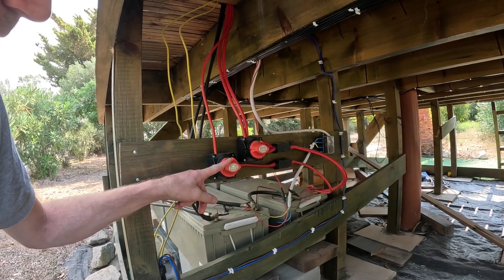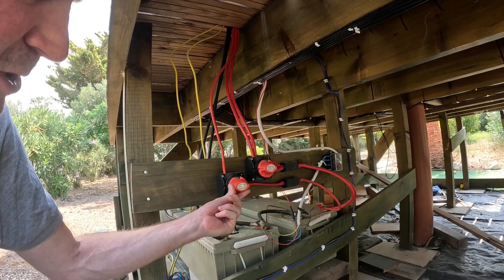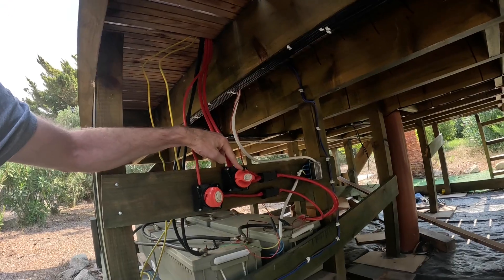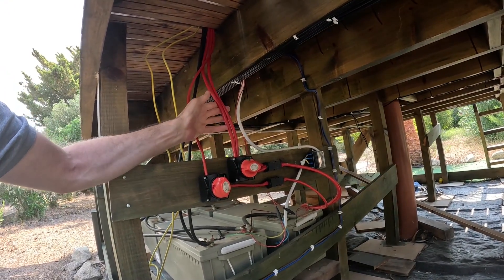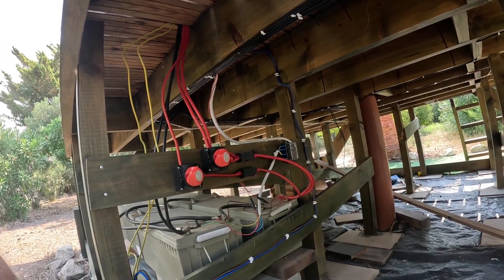Right, let's get to it. First thing I need to do is go down underneath the observatory and turn off the battery system supplies. Here we've got the cable coming in off the solar panels - I can turn off the feed coming in from them - and then this one here is the main isolator coming off the batteries and feeding up into the observatory, so the system is now dead.